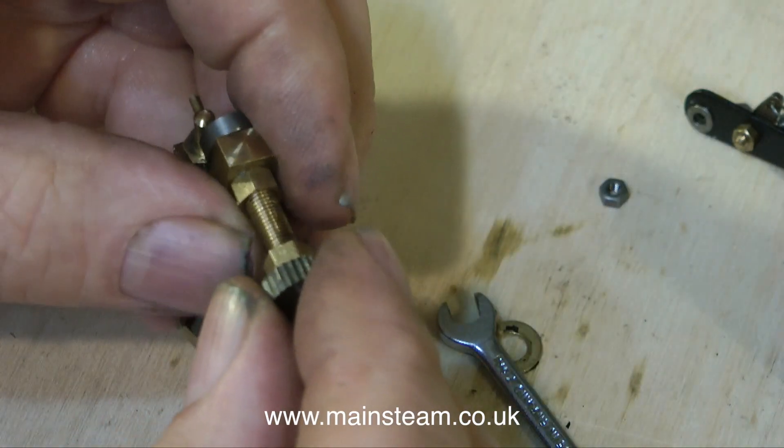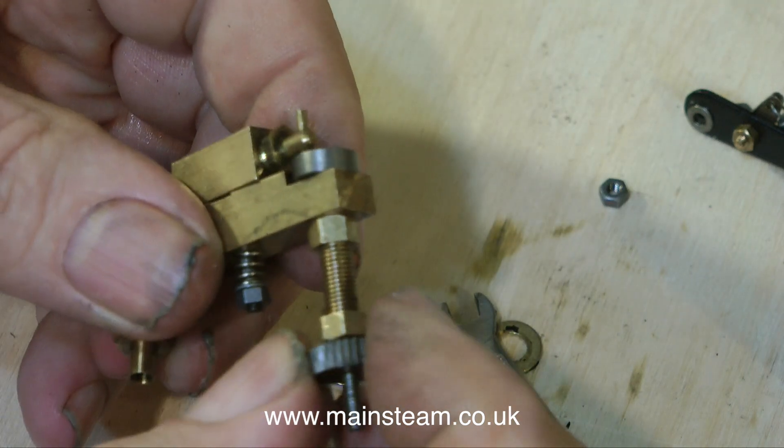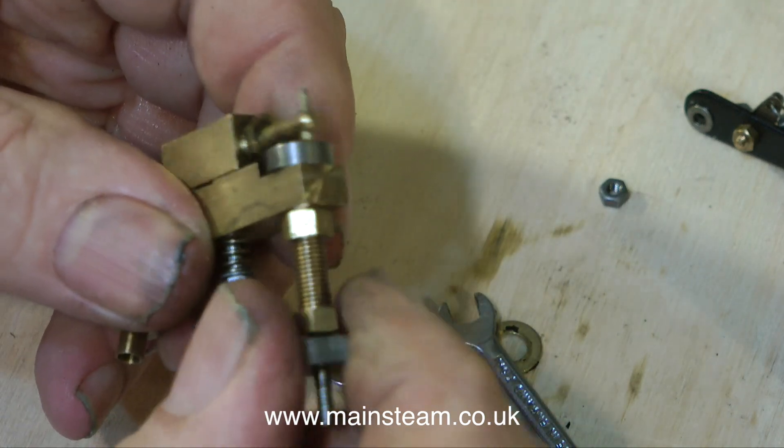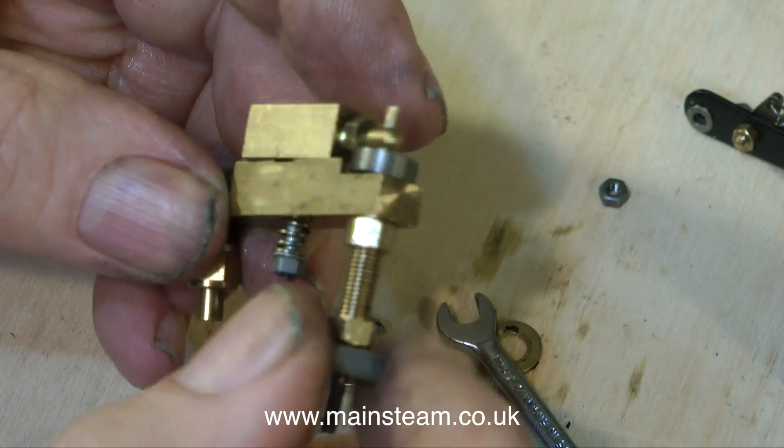In this clip you can clearly see just how much play there is in the crankshaft of the pump, so all I need to do is just remake the threaded part, making sure that the diameter of the hole in that matches the crankshaft of the pump.